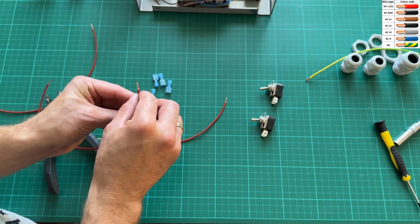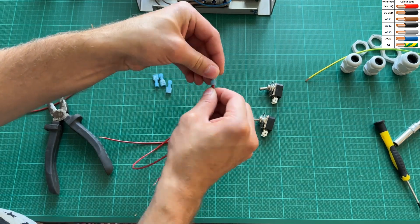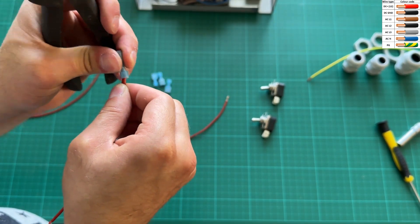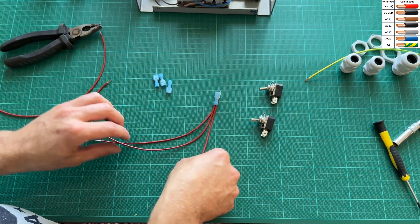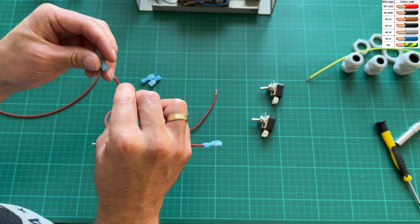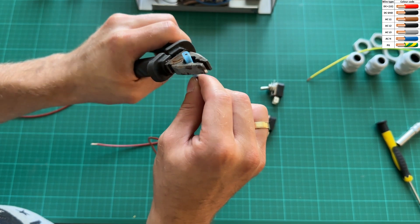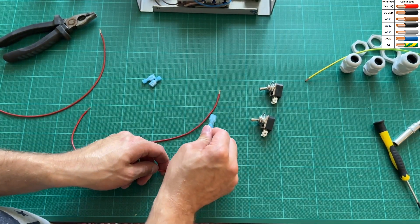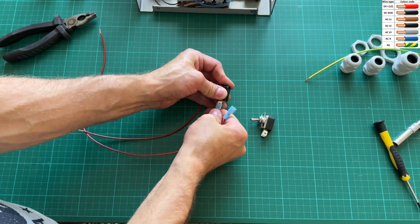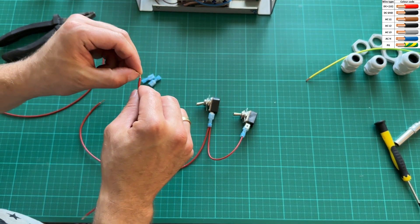Next step is to wire together two switches used to control the heating elements. I have two pairs of heating elements — two on the left and two on the right. I designed my oven so I can separate the left and right sides with a wool wall in the center. If the wall is placed in the center, the left side has two elements and the temperature sensor, while the right side contains only heating elements. I have to control the heating elements so that you can't have a situation where the oven is separated by the wall, the sensor is on the left, but only the right-side elements are on — because then the right-side elements won't turn off, as the temperature sensor won't detect the heat, and the controller will think the oven is still not warm enough, while in fact the right side has already melted down.